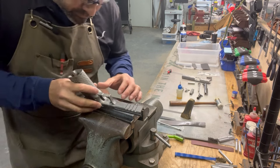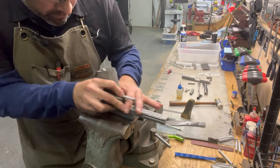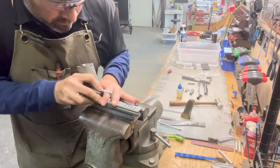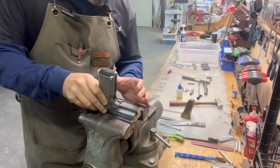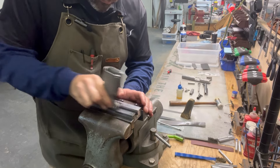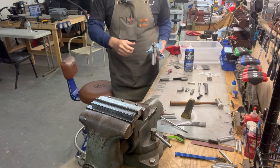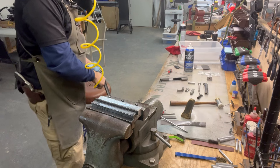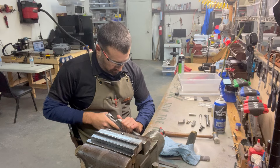This is a 90-degree jig that holds a stone. I've got some 500 and 1000-grit oiled emery paper, and this fixture helps me hold the frame at a perfect 90-degree angle, keeping those slide rails nice and true. It's just a process of: take a little material off, oil it, fit it, see where it's hitting, and repeat until the slide and frame go together.